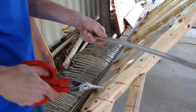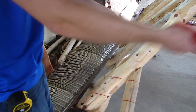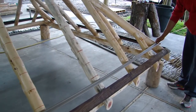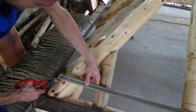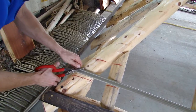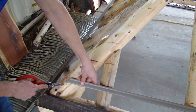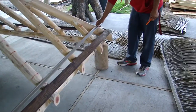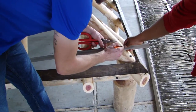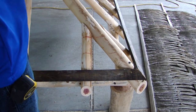For each rail, you want to cut your railing first by setting it up on the mark — your first four and a half inch mark from the one by three. Have your helper hold it up on his side as well. You want to cut a 45-degree angle, roughly 45 degrees. Hold it on the mark at about the center of the hip, then go to the other end, mark it at about center, and cut that one. Then you can slide your leaves onto these.